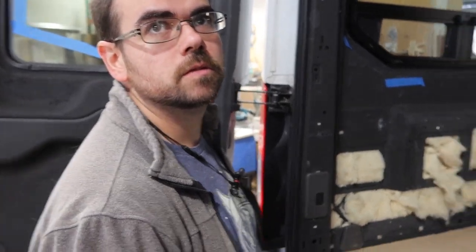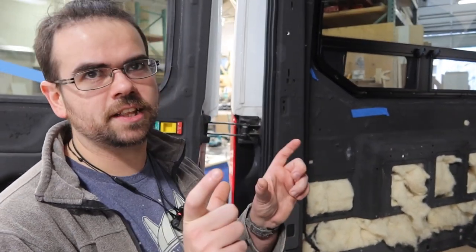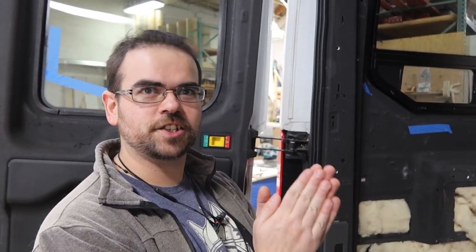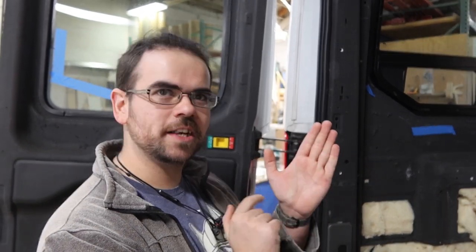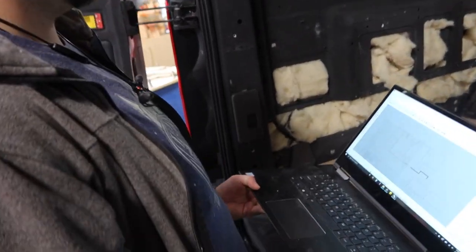What are any rules of PEX? Like, the curvature can only be a certain radius, right? Yeah, we actually did a test, and we can bend it all the way down to, I think, a 4-inch diameter, I believe. Okay. But nothing narrower. We try to make it about a 6. Okay. 6 or 7. Yeah. Because there's the metal flashing that also goes on it, and with a 4-inch diameter, the flashing is touching. Which means you have no space in between to anchor it down, and we don't want that. Yeah. Got it. We'll sit down and have some fun. Some computer time.